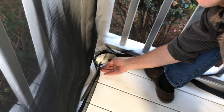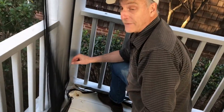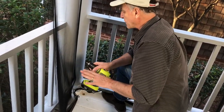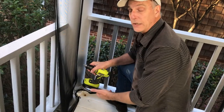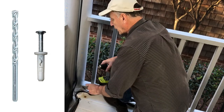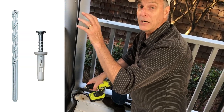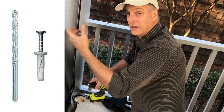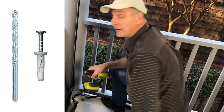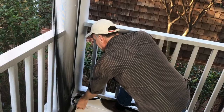If you happen to be going into masonry, the curtain needs to go around something, so you're going to have to get it into masonry, concrete, or something like that. The only difference between drilling into masonry and drilling into wood is you need a masonry drill bit, and then you need a little plastic insert to receive the screw — almost like you're hanging a mirror in drywall with those little plastic anchors. You put the same sort of plastic anchor in the concrete so that it doesn't chip away at the concrete.